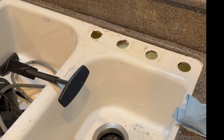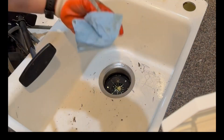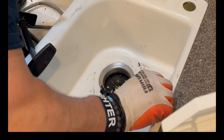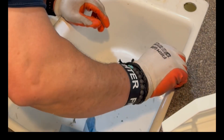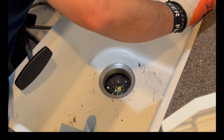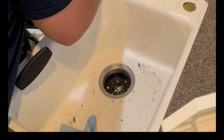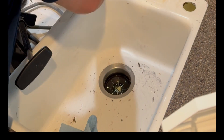This part of the job is the most meticulous aspect of re-caulking — whether it's your sink, your bathtub, around door sills and window sills, or anything like that. The reason is you have to remove all the old silicone in order for your new silicone to actually adhere to the gaps and make a tight seal. If you don't remove the old silicone, they actually repel each other and you get gaps where water or air can travel through.